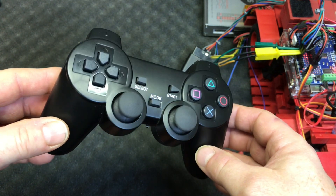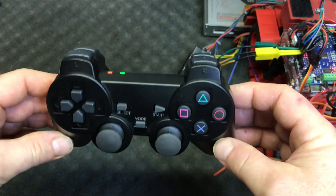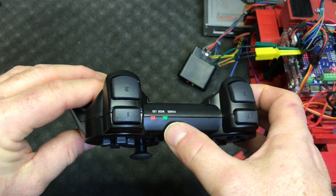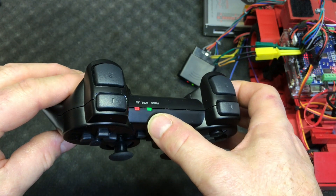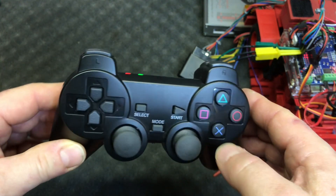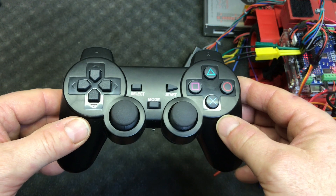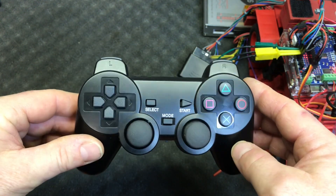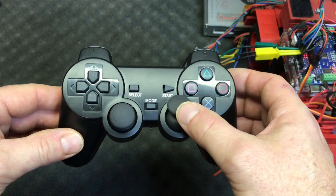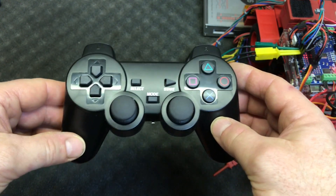You can read them with a value between 0 and 255. You also get two fully functional joysticks in both directions — X and Y — with analog values between 0 and 255. The device has two modes: a digital mode and an analog mode. The digital mode is only for older games that don't support analog values, so we use it in analog mode to read pressure-sensitive keys and the full byte range for both joysticks.